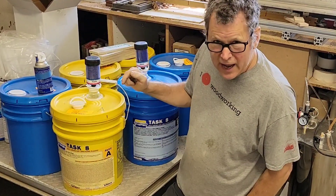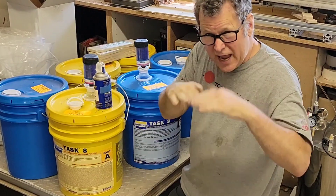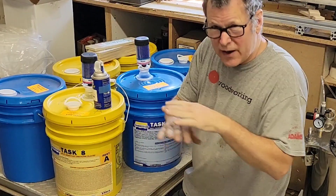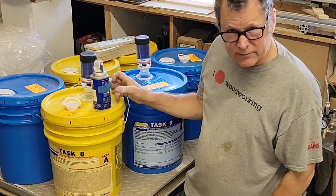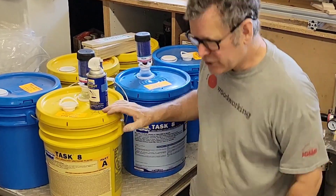This argon gas trick with Extend It also works for varnishes. If you have a can of varnish, you know you get that skin inside the can — spray that in there and it will help prevent that from glazing over. So I hope that helps. Makes your urethane go longer. Thanks for watching.